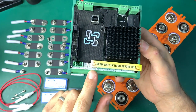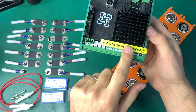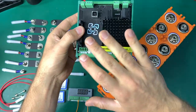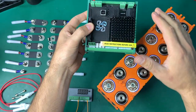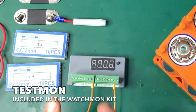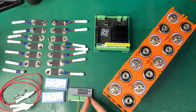This is your WatchMon 5. When you receive it, read the instructions before use. Do not plug the connectors and start wiring straight to the WatchMon — for any BMS, that's a recipe for disaster. This is why we have test mode: a little handy device to check that the voltages are incrementing correctly.